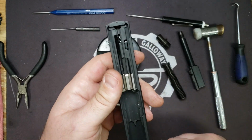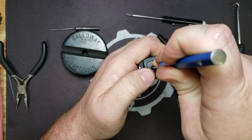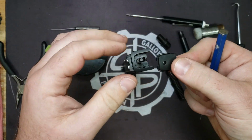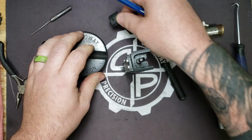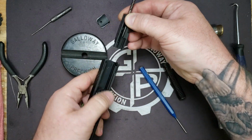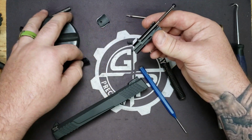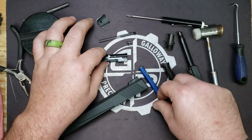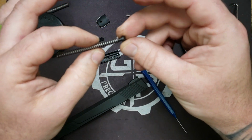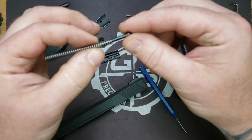Pardon me. But let's go ahead and take the striker and striker assembly out. If you're following along and you're wanting to play with yours, be sure to keep your thumb over that striker because it's under a lot of spring tension. And now, with the back plate off, you can pull the whole assembly out. Now, your lifter might fall off like that just did, but it is multiple pieces. So there's your striker. Got your striker guide and spring, and we're already working on aluminum and steel striker guides.